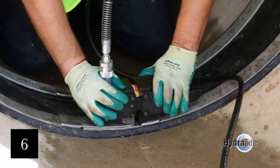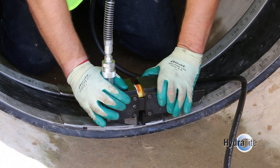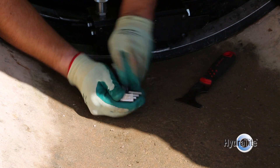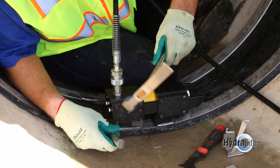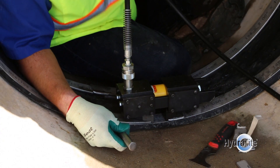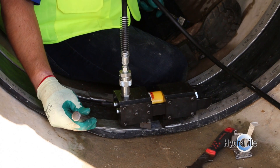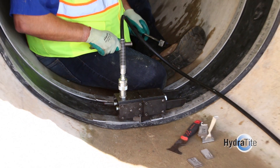The sixth step is wedge installation. The wedge is installed at the gap provided by the expansion process. The size of the opening is measured and the appropriate wedge is selected, then inserted into the space provided. Wedge insertion is generally performed by a brick hammer. The size of the wedge should be slightly more than the opening available. After the wedge is installed, the expander is removed.